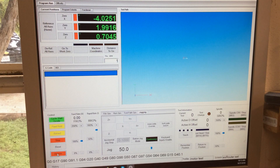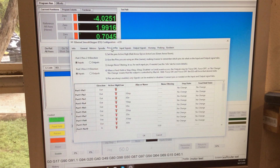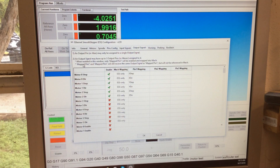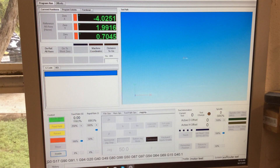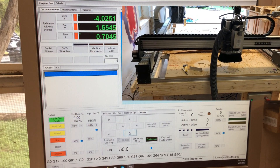Disable. Configure, plugins, motors. We've got to find a way to link port 1 pin 8 up to port 1 pin 4. Mapped pin 2 and map pin 3 will still receive the same output signal as map pin 1 but will not be referenced in Mach. So this is how we do it — pin 2 mapping, we're going to come here and make this A step, A direction. Let's try that. Enable it and try Y now. Totally did the trick!